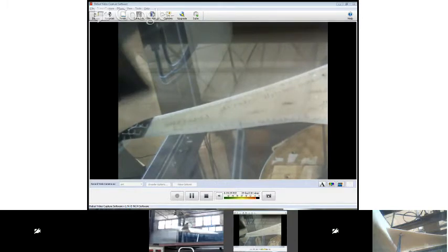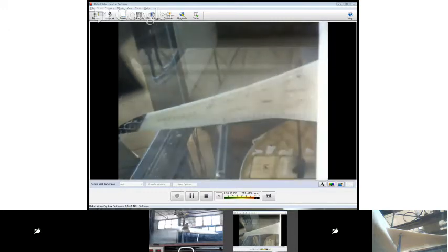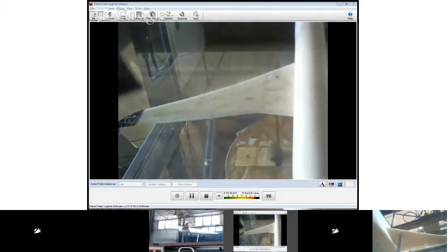So as it progresses a little bit the same, we switched to the top view. Up here, we were at about 16 degrees angle of attack, and then we went up to 18, and you can see that the wing is pretty much stalled at this point. The tufts are going up and backward compared to the normal direction, so we should be able to see this result in the data.